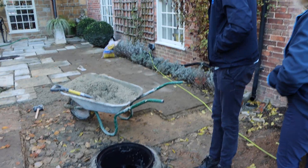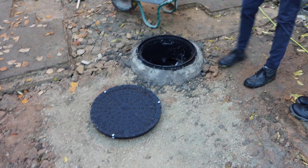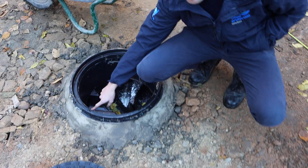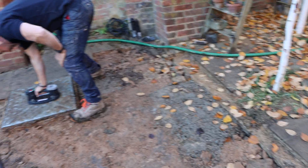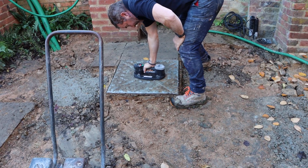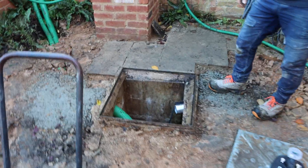You can route roof drainage from the gully there into here. Your roof drainage all flows that way, but see this here — it's a high level overflow, so if it all gets too much, it diverts into here.